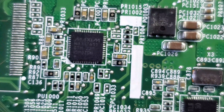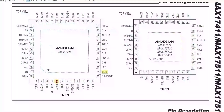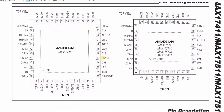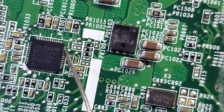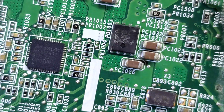Next, I measured the pinouts of this power supply chip in continuity mode starting from pin 1. Pin 5 looks like it has a short - but checking the datasheet, pin 5 is ground, which is fine. Pin 17 also has a short - looking at the datasheet, pin 17 is meant to be connected to ground, which is also fine. Pin 19 has a short and pin 20 as well. Looking at the datasheet, pin 19 is called VDD - this is the VCC for the internal regulator and should not have a short. Pin 20 is meant to be connected to ground, so that's fine.